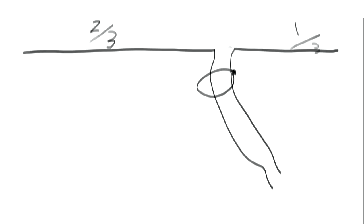However, that feed point impedance changes. And when it was in the middle here, we had 50 ohms or, you know, close. If we move it to one edge or the other, that impedance is increasing. Actually, what it's going to be out here, rather than 50 ohms, it's going to be increasing. Let's say it goes up to 400 ohms right there. Now, it's still going to radiate and be resonant at this frequency, but the feed point impedance is going to be higher. Well, how do you handle that?